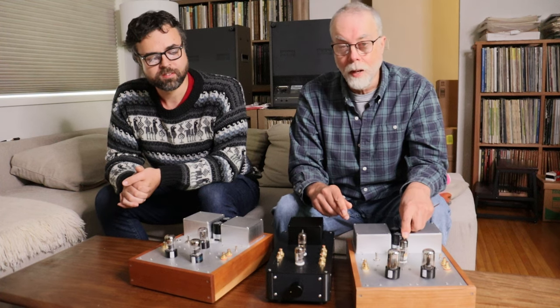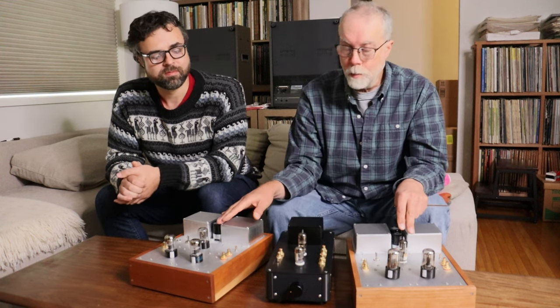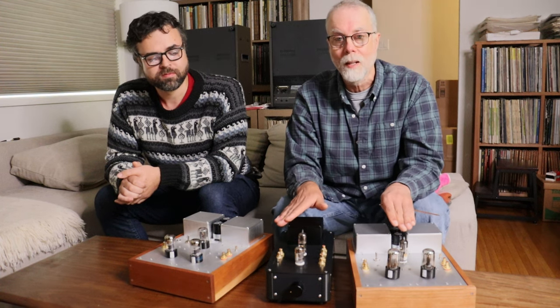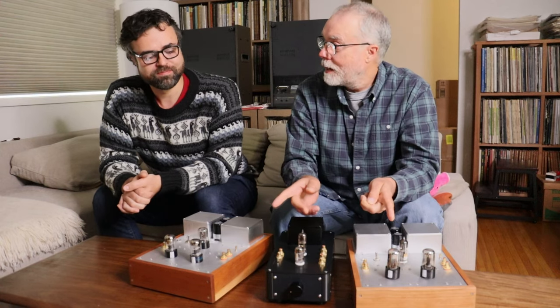We have them in the store, and you can have the same identical cathode follower circuit — the circuit is identical, resistor values are identical. The current draw will change because the tubes are very different. Now, you can't just drop a high current tube like the 6N6P into an adapter into any position that the 6SN7 takes. That is a recipe for magic smoke, disaster, burnt up amps, fire, possibly even death.